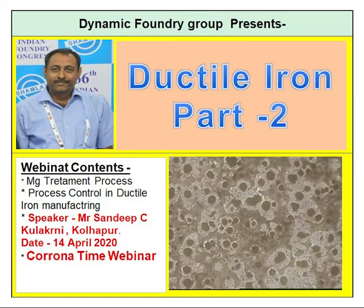Residual magnesium and magnesium recovery has always been a subject for discussion. As I was discussing with you, various factors are there, and we can see one by one all those points once again. The sulfur content in the base metal is one of the factors. If your sulfur is low, then definitely your magnesium alloy percentage will be less. If sulfur is high, you have to increase your magnesium alloy.